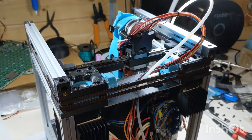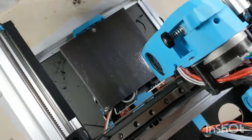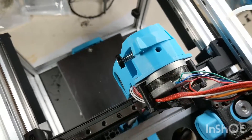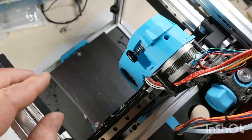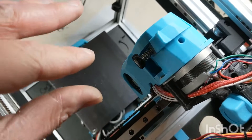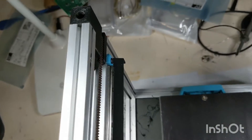Hopefully you spotted the problem before me — I had forgotten to put the belts through the carriage. I've done that now as well as pulling the tool head back on. That was really difficult, especially because the shape of the new X carriage didn't allow for twisting to get the belts inside. I had to take the front idlers off. It was a real pain.